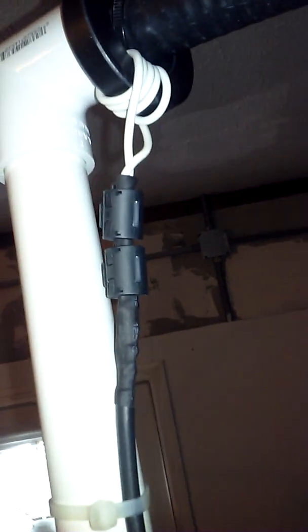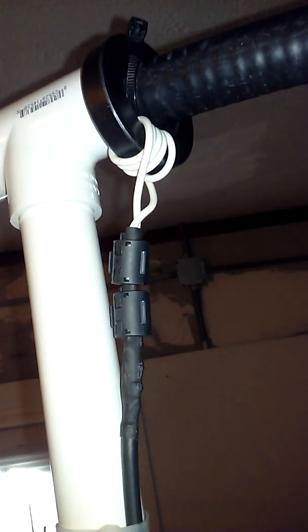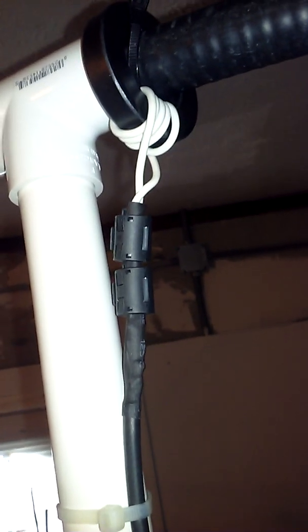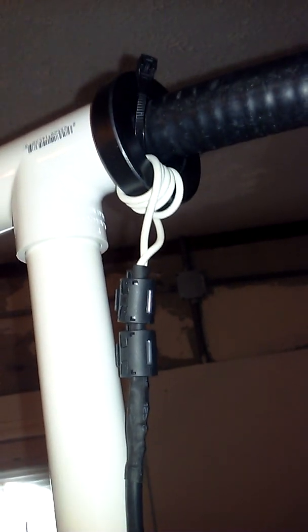What you could do is strip the shielding back on the coax long enough so that you can make four or five turns on the ferrite. You wouldn't even need the white wire — just use the end of the coax and run it through there four-and-a-half times, then solder it to the shield. So that's something you can do.